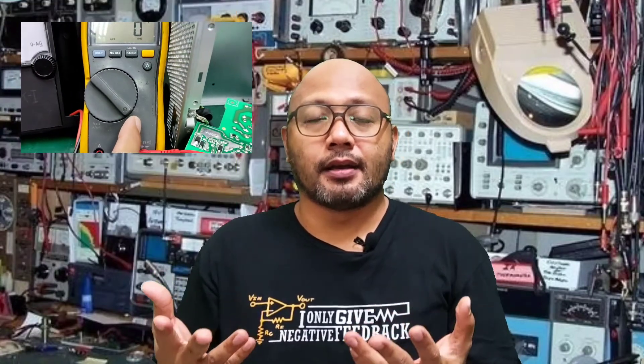You need some tools that give you the fastest way to solve your troubleshooting problem. A helping guide like an ESR meter is very useful because most of the time with appliances, some capacitors are hard to determine as spoiled, broken, shorted, or open. So you need this kind of tool — this tester, this multimeter, ESR meter analog or digital — you must have this in your electronic shop so you have less time to troubleshoot and it's easy to find the fault.